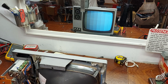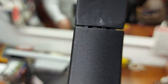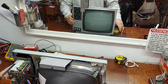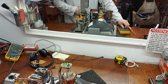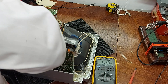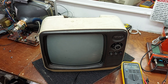I wonder if it's the earphone jack socket. It looks like it's been installed somewhere very damp. The speaker could be open circuit too. Let's see if I can hear anything in a pair of headphones. Nearly took the head off! I wonder if the speaker is open then. We'll turn it off and put the meter across the speaker — 16 ohm speaker. Speaker is gone. Open circuit. Well, that was an easy fix — I'll have to dig out a speaker for that one.